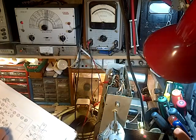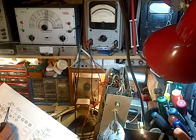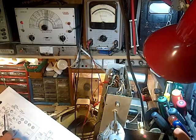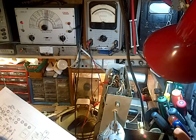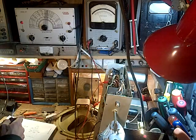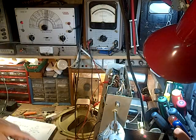Number 5, another oscillator coil. We'll leave that alone. Oscillator trimmer midband. Oh, wait a minute. No. Adjust at 7.5 megahertz. Still, it's an oscillator adjustment. Don't want to touch it. That's operation 6. Operation 7, RF trimmer adjust at 1500. Okay, we're up at 1500.